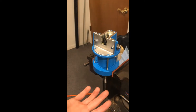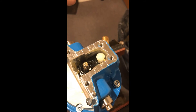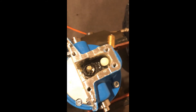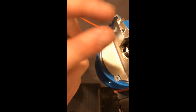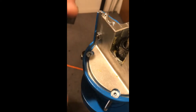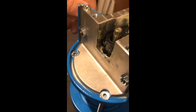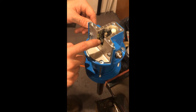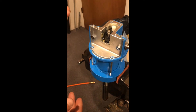This is a very healthy looking pump. This is your control piston in the back — sometimes that can get held up. Other issues are those rocker arms have gone completely flat. You'll see these in the complete vertical position rather than being like a 45-degree horizontal position. Your carrier coupling — the black piece in the middle — if that's all bent up or out of sorts, maybe you have to replace that.